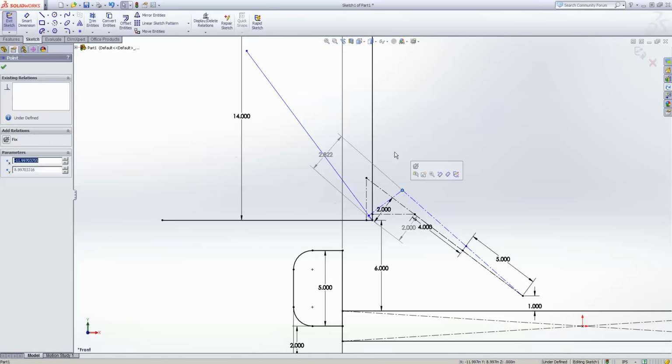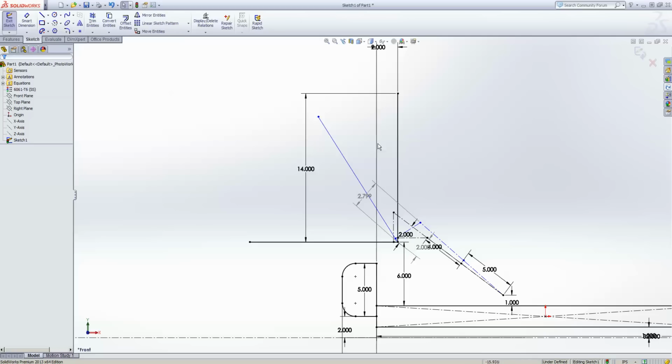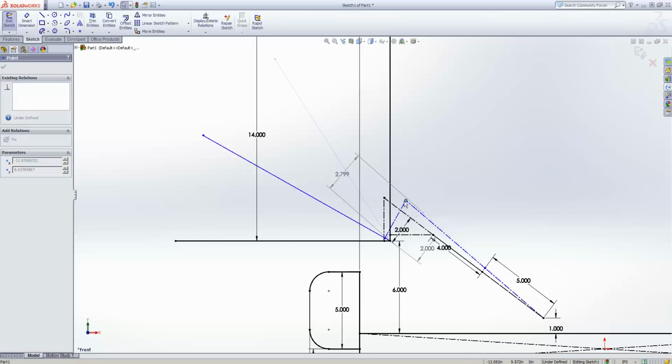And what's cool about this is you can use this to go through your range of motion and see, do I always have a big enough lever arm? Because it would be possible to design a system that in the starting and final configuration has a big enough lever arm, but then goes through a point that it doesn't, or goes through a toggle or that sort of thing.